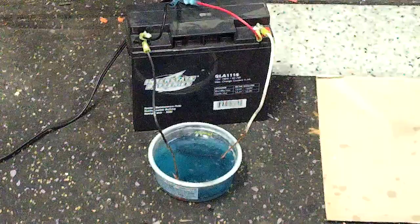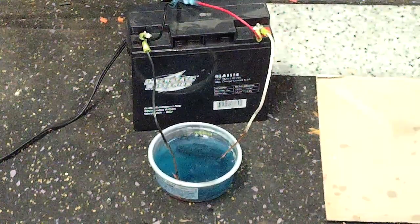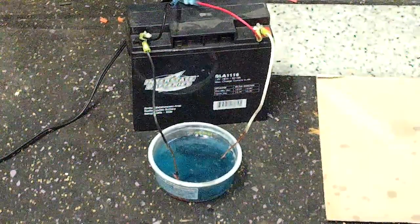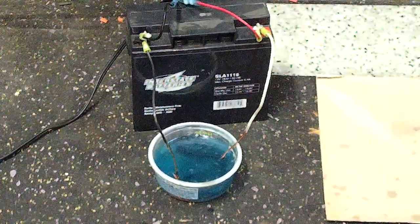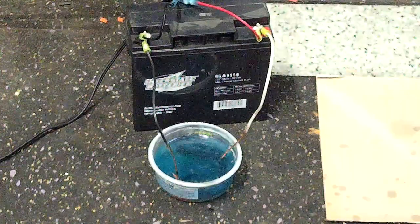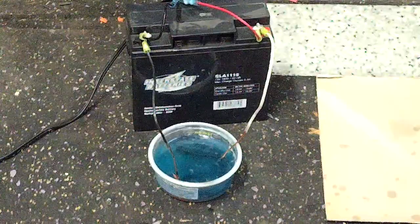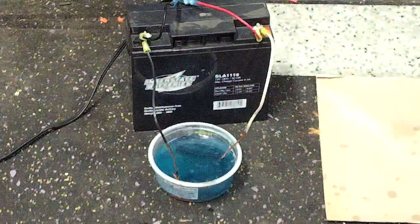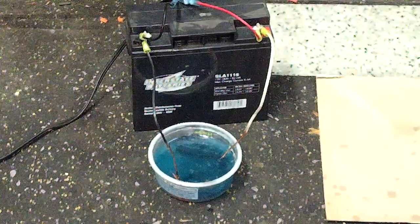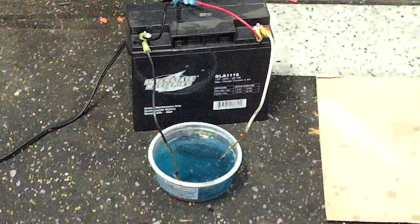Second, you need some sort of electrolyte. In my case, I chose white vinegar and a very, very small amount of water just to keep things flowing. Apparently just vinegar by itself is not the best, from what I understand. And I had a piece of scrap steel that I lightly buffed with a stainless steel wire brush and put in the soup.